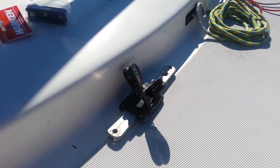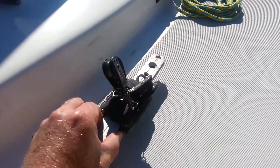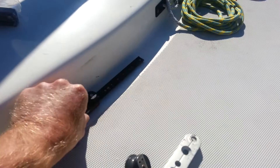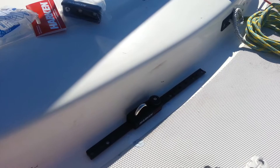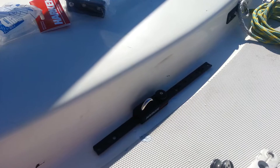What I'm going to do — and I've already started it — is remove this track. I've already filled in the holes that were there, and I'm going to replace it with this much smaller profile and simpler Harken track. As you can see, it can get much closer to the cabin top. I measured it out and it actually pulls the jib sheeting angle in about a degree and a half, which is significant.